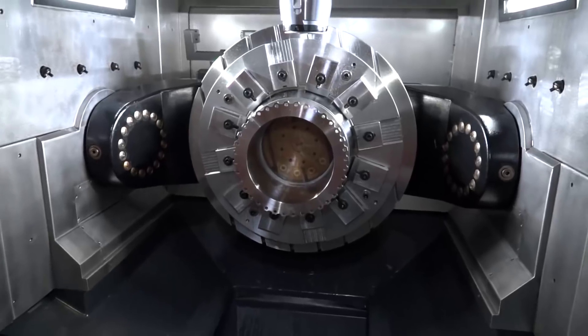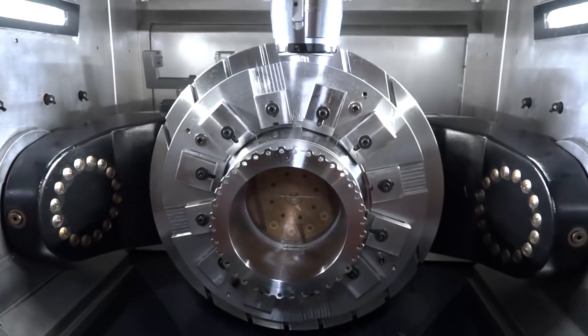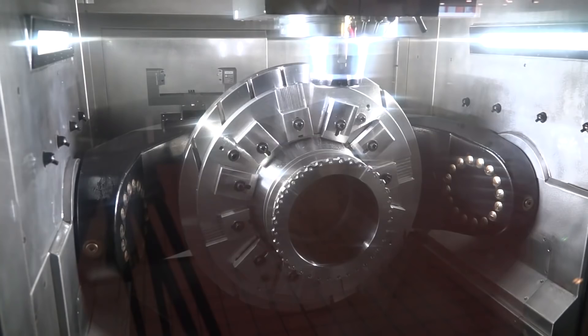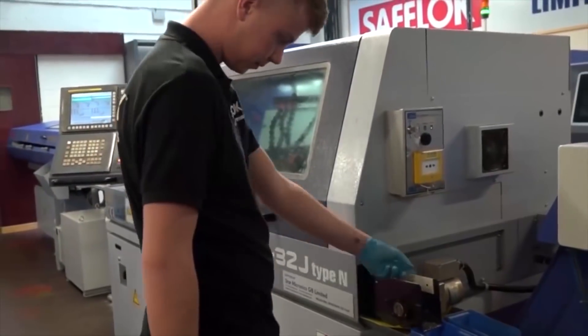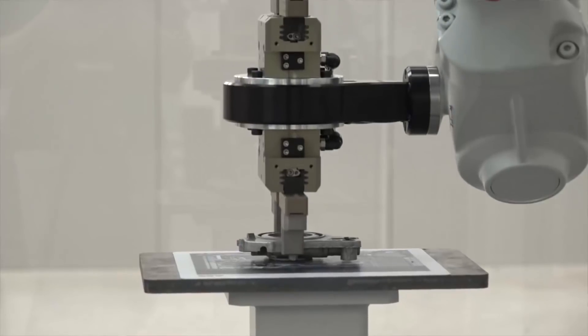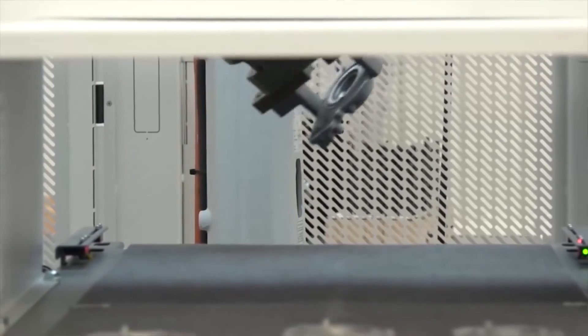It's an 800 size table on this machine with 800mm in the X-axis and 900mm in the Y-axis. The sliding head option — we found we could buy a machine for less than half the price of one of ours and move some of the work onto that machine. Automation and machine tending is ultimately about making processes more efficient.